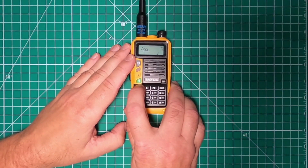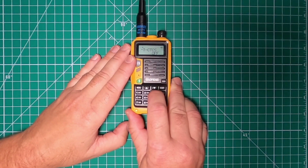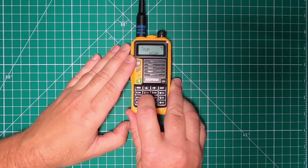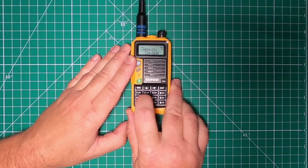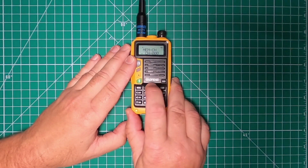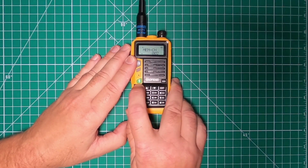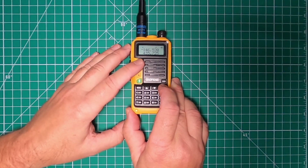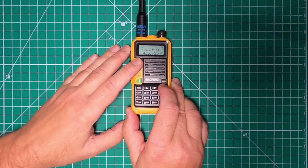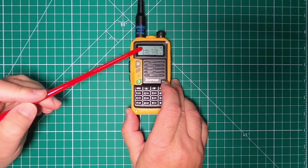Go into the menu. There are a few things you want to make sure are turned off. One is menu item 13, which is transmit CTCSS — that's already off. Then go to menu 25, which is your shift — that's already off as well. Then program it into a memory channel, which is menu 27. Hit menu, pick the channel you want — up to 127. We're going to use channel 2. Press menu again — you should be locked in. Exit out, switch back over to memory, and you can see the number 2 in the corner showing which memory slot you're in.